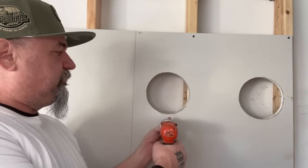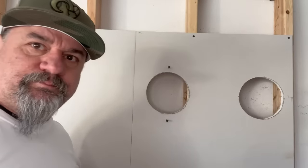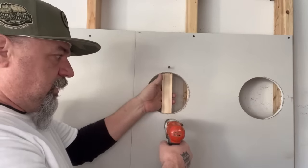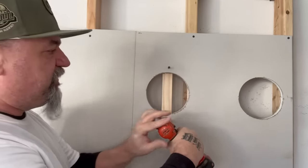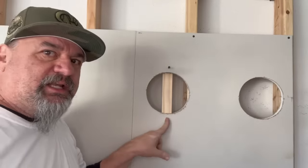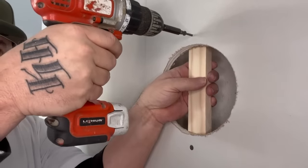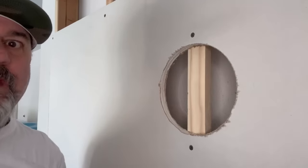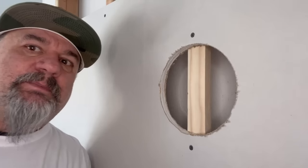I get mine started — about center, one, two. We've got our wood backer here. You just kind of feather it in; you'll feel it grab. Be gentle with it, feather it in. It just has a little indentation. Same thing up top — pull it in, feather it right in there. You could do more if you wanted to, put more screws to hold it, but it's not supporting anything so it's not a big deal.